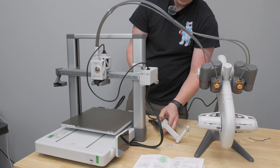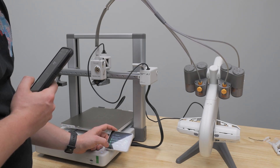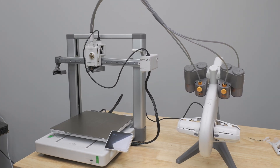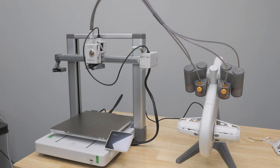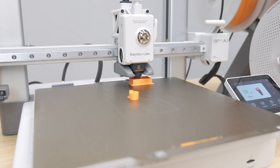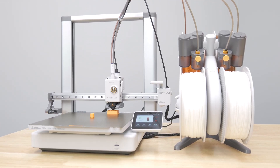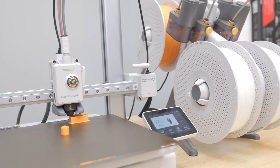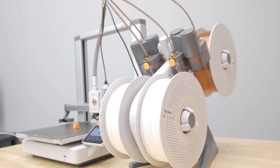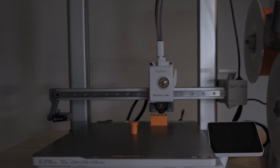One of the extra parts is a single spool holder for if you just have one spool. We then run calibration for better printing quality — the printer basically auto-calibrates. For $489 at the time of buying this combo, you get multi-color printing — up to four spools at once — and you can even mix and match materials slightly, like PETG with PLA, assuming it lets you calibrate the heat levels for each. You also get active flow rate compensation, active motor noise cancellation, full auto calibration, a one-clip quick-swap nozzle, and a 256mm cubed build volume.